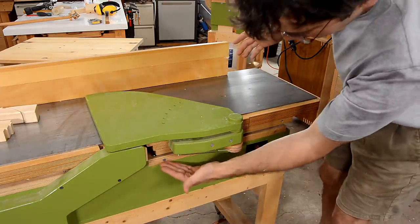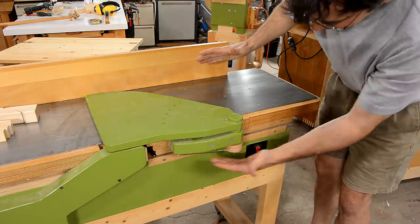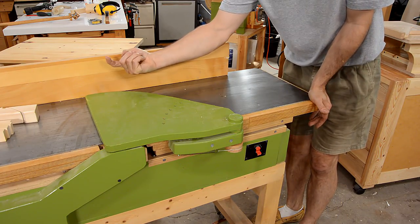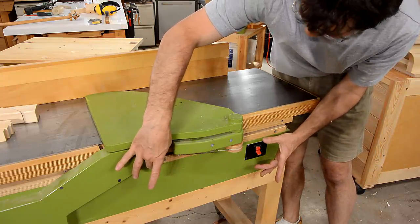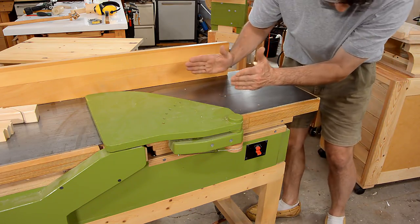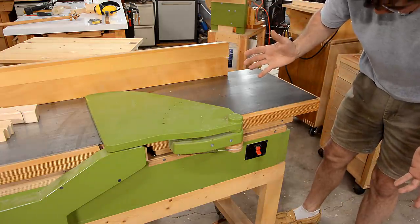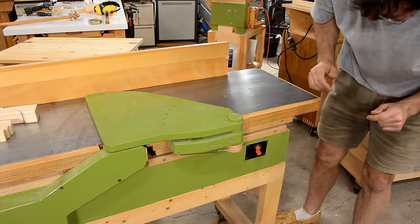If I had used an inclined plane here, first of all my chassis would be kind of broken up. And if the inclined plane doesn't come out all the way, if I have the table overhanging a little bit, what if I put load on it? I don't want this end of the table to come up, which means I need a whole bunch of springs to keep that inclined plane in tension, something to guide it really precisely so it doesn't twist, and a whole adjustment crank — because there's going to be a lot of force to slide that table up and down and I don't want it to bind. Thinking about all of these problems, I eventually decided that just having a parallelogram mechanism was really good at solving all of them.